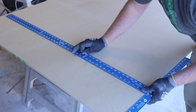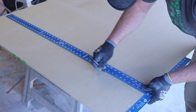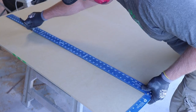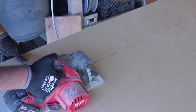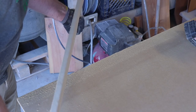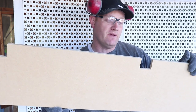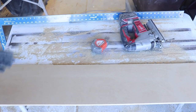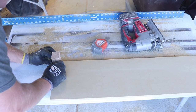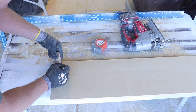I've got my drywall t-square — it's great for getting a nice straight line and works well for cuts around four feet wide. I'm cutting the shelves out of half-inch MDF with the circular saw — should be plenty sturdy with the supports underneath since the shelves aren't super deep. All the shelves are cut out; now I'm going to notch them so they fit right down in between the support boards. I've got the jigsaw out and a scrap piece of wood the same size as the support material to trace the notch.